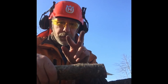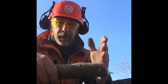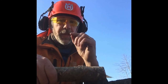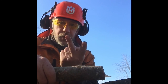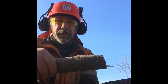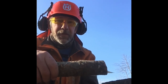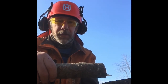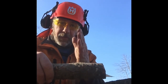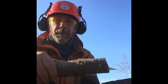Sometimes those jobs will switch partway through the cut. I'm not talking about ripping logs — I'm talking about cross-cutting. The fundamentals are: side plate cuts the fiber off, top plate knocks the chip out. But in the real world, those two jobs will switch back and forth, sometimes partway through the cut. So the trivia question is: why would that happen? If you think you've got the answer, put it in a comment — be interested to see what you think. That's your homework assignment. Hope to see you at a Game of Logging program, where we'll carry this information into what style of chain to use for your different cutting applications.